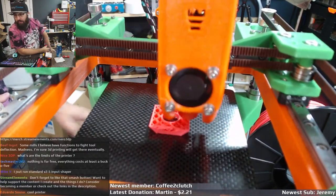There's a reason speed benchies are one single thing. You don't print full plates of parts at speed benchy speeds because the parts would come out looking like shit and have layer adhesion issues. Nobody's printing full plates of Voron parts at those speeds and getting good parts. And also that's why they do that loopy thing. It's like vase mode. It's a demo thing.